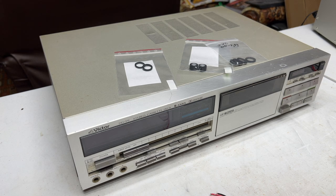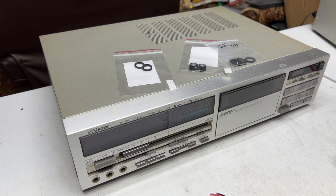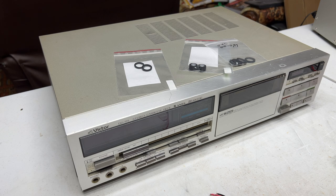This video will be the transport service. I want to get that out of the way first. The Sony 666ES taught me very firmly that it's best to get the transport done first and wait on the capacitors until the transport's working. So that's what we're going to do. Transport service in this video. Next video will be electronics, because there's going to be a lot involved with replacing the capacitors and whatever else it needs on the electronics side of things.